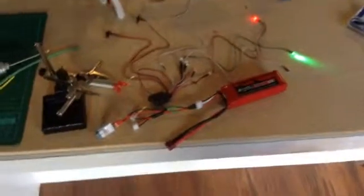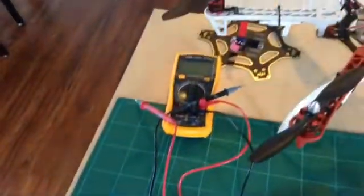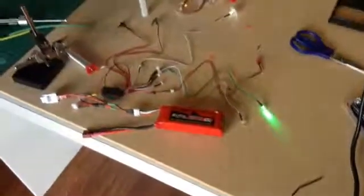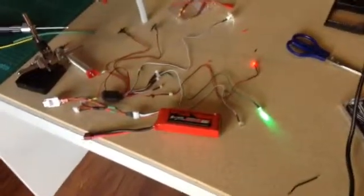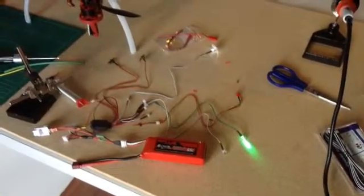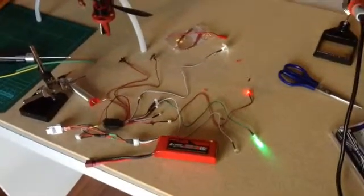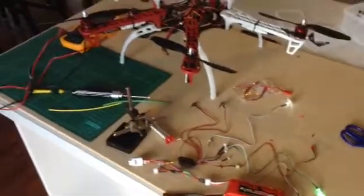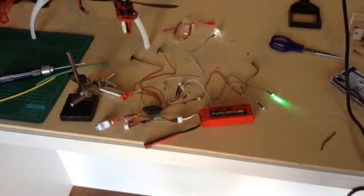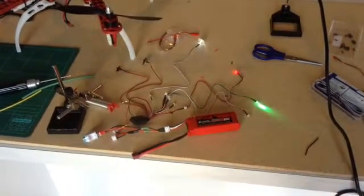As you can see here I've finished wiring in the BEC connector. Played around with the voltage — had that hooked up to the voltage meter just to make sure it was a true 5 volts. It's connected up to the flight battery, which is of course a 3-cell 11.1 volt battery. Those lights all seem to be operating properly. There's a few more to connect up, but at this stage this is a great little test. Pleased that I haven't had any little clouds of smoke or sparks yet, so I'll press on and finish wiring this up and show you the finished product.